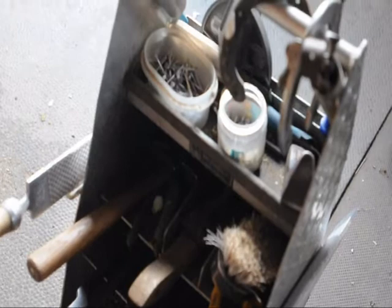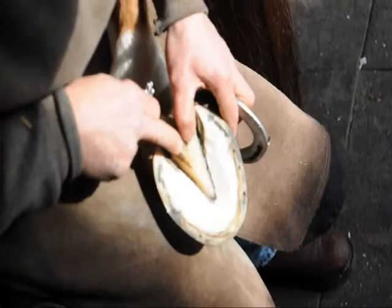One horseshoer came up with this theory, and it's very true. Like the FBI has fingerprints of the people in their database, and they're identified as like four different types, you know, swirls. So everybody's in a different category. And this other farrier got five different types of feet, and one is very symmetrical, and he put a name to them. So the idea of that is that you look at the horse, identify what type of hoof shape, go to the anvil, draw it up, and you'll be very close.